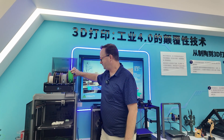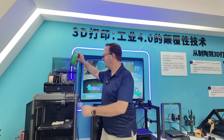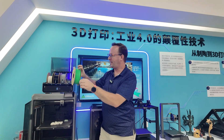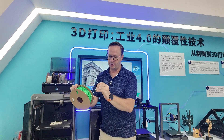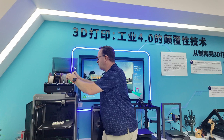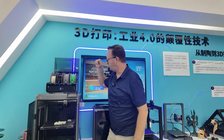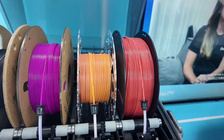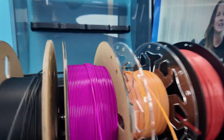I just learned this today: if I want to take the filament out, I can just pull it out like that. I kept one finger on here so it doesn't spring back — I hate getting a twist in my filament. Then you can tuck it away as normal. To load it, you stick it in and the machine takes over right there. You don't have to push anything. There's a little lever for manual changes but it's done automatically.